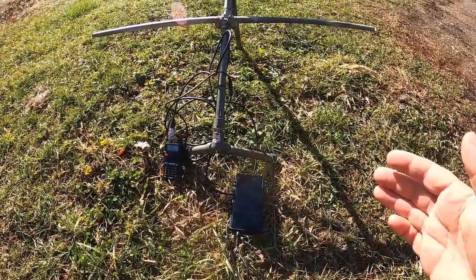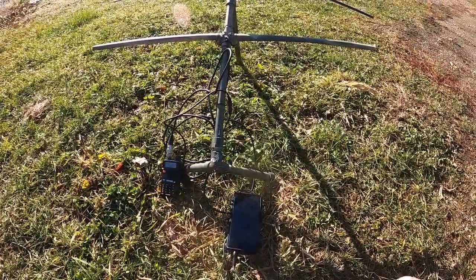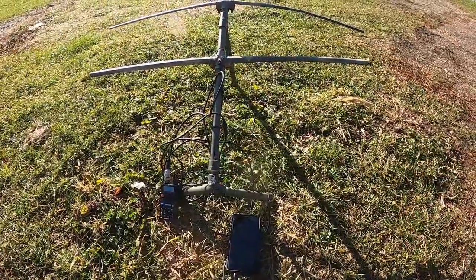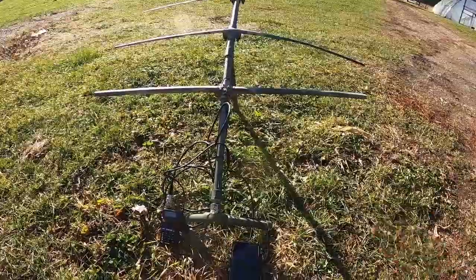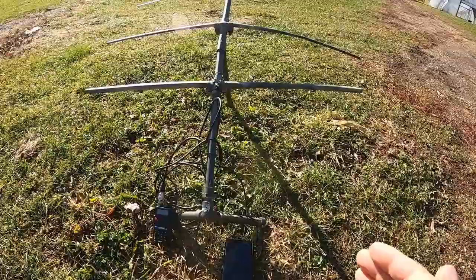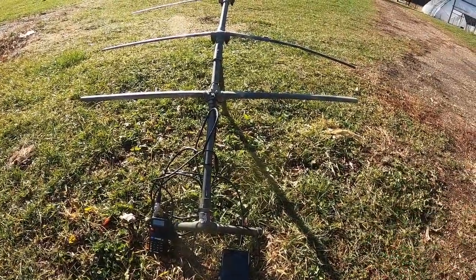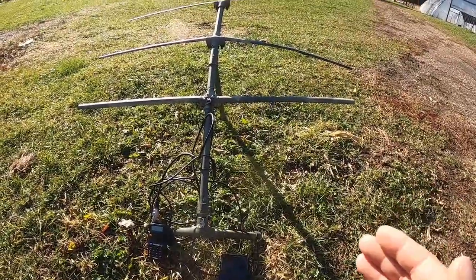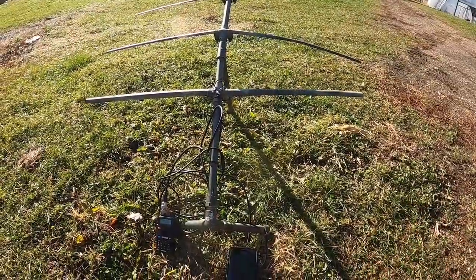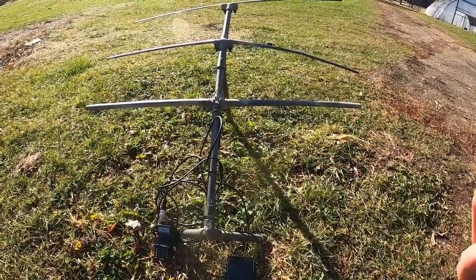If I want to send that message, I want to make sure it's the lowest possible power and that it's a directional shot. A Yagi is kind of like shooting an arrow as far as your broadcast goes, so you want to be very precise with this — this is what you'd use for tracking. Low power as well, so the signal isn't going everywhere.